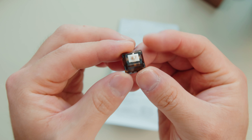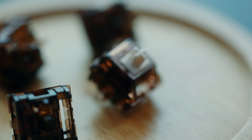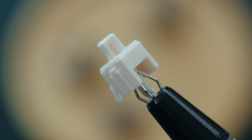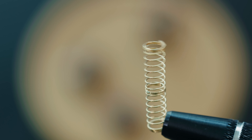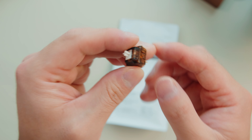The Ice Latte switches look absolutely amazing — I really love the color combination. If you look closely, they have a translucent polycarbonate housing with sparkle specs on it, and a nice cream-colored long-pole stem. These switches have a 55-gram bottom out with a two-stage 20mm gold spring, and they come already hand-lubed with 205g0, ready to be put inside your board. For me, having hand-lubed switches is a must when purchasing switches, because nobody's got time for that anymore.